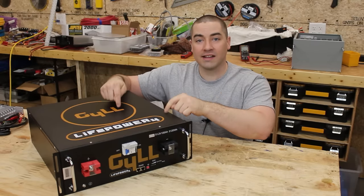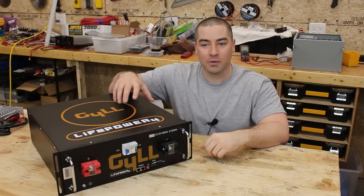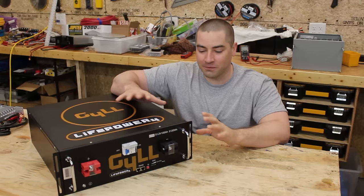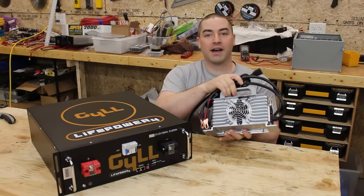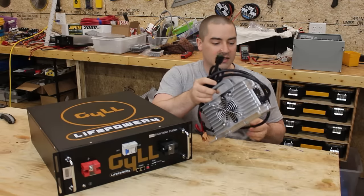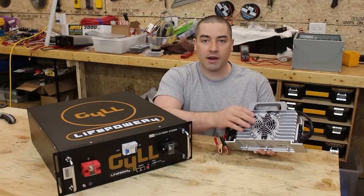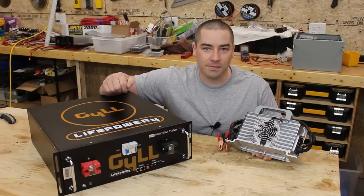In the next few weeks, we're going to be doing a lot of testing on this battery, as well as the others that came on the pallet with it. We're going to put it into the server rack. To charge it, I did buy their optional charger — a 48-volt, 25-amp charger. In a future video, I'll probably test the efficiency of this charger. But right now, let's just top it off so we can get a capacity test and find out if it hits the rated 5.1 kilowatt hours.